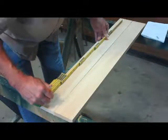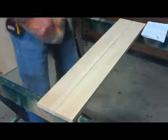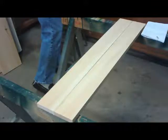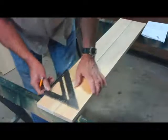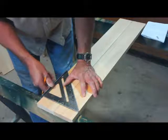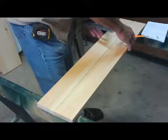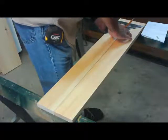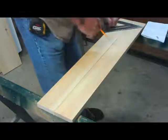On the other end I'm going to go right to my 29 and 7/8. Those two marks will give me my inside dimensions of my styles. I'll use my speed square again as I'm transferring these marks, using the same dimensions for both pieces. Put these on lightly because we have to sand these pencil marks off afterwards — you don't want to be gouging into your piece of wood just because you've made your pencil marks too deep and strong.